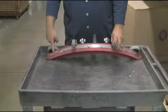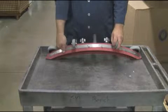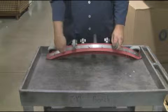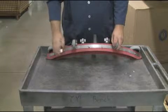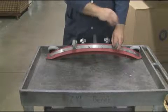Your squeegee is held in place with 8 stainless steel wing nuts. It is important to install the squeegee bolts the exact same way that they were removed, because each bolt is sized to each slot on the squeegee assembly. See your owner's manual for more detailed instruction.